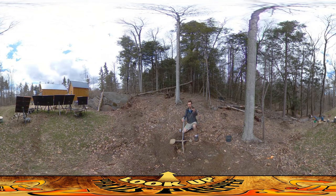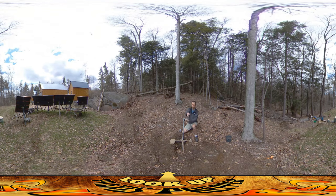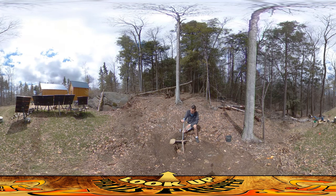This is the positive and negative lead that heads down into the root cellar. I'm about to snip some of these so they'll fit inside this little box. This isn't actually really an electrical box — I use them as one, and I don't know if they technically can or should be. These are meant for pulling wire through half-inch conduit around bends. There's a back panel you can pull off if you have too many bends. But I like to use them as little makeshift outdoor electrical boxes. I haven't had any problem with that — I don't know whether it's to code, but they seem to work pretty well.